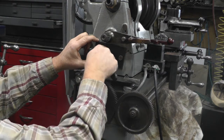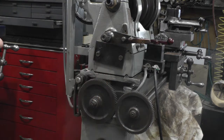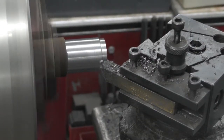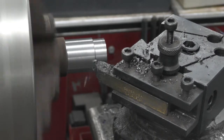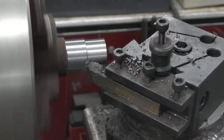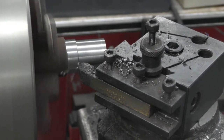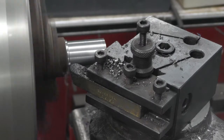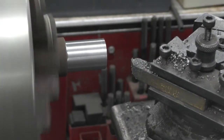So next I guess I'll build the stud that's going to go on there to hold the gear, and then we'll figure out where it's going to be. Get that stud made. Well, I'm using the Garvin to make parts for itself, so working on that shaft for that gear to mount on. I got to turn this down to 1/2 inch. And she seems to be working very nice. Got a ways to go.